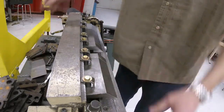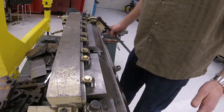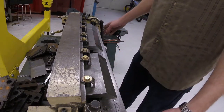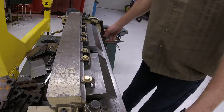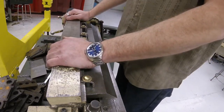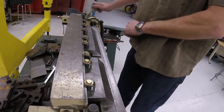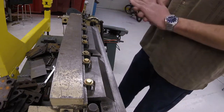One other thing to remember with this machine: these handles are heavy. Please don't drop the handle — don't just let go. It bounces, and that's really hard on the machine. You also want to make sure you've got your blood circle area between you and the next person. This handle is low enough that it can catch you in the kneecap if somebody else is standing right here. Watch for pinch points — this whole bar moves, and underneath the fingers is a clamp, a pinch point. This piece rotates, so we've got pinch points there too.